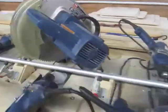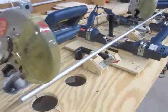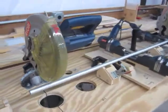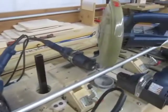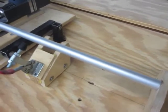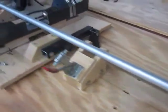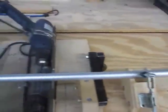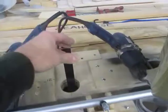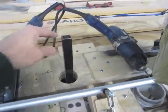This is the last day of the old seahorse machine because we have a new one. This is how it works: there's one chop saw, another chop saw, and six drills. You put the aluminum tube down through the slot up until the stopper, then put down all the clamps — four of them. Then you run the drills this way and pull this way and drill these three holes.